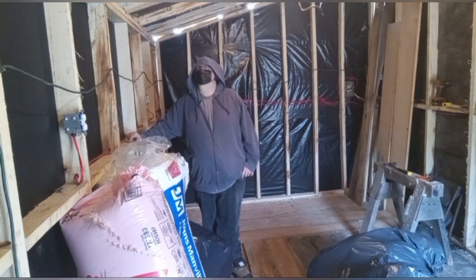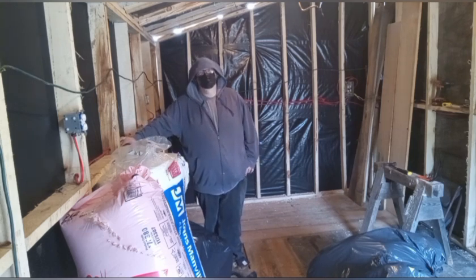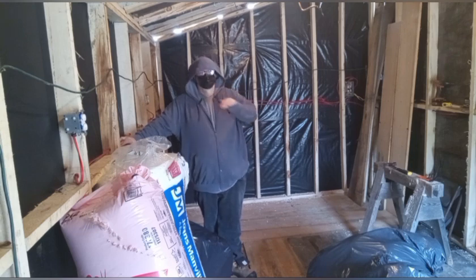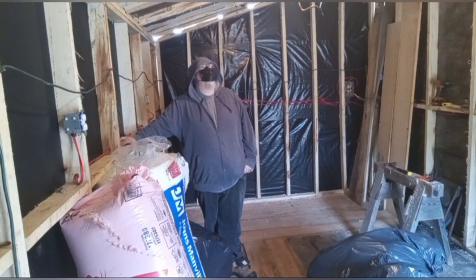In the last video, I was talking about putting cleats in for the foam board insulation in the ceiling. I had to scrap excess 3.5 inch ISO insulation, polyiso. For anybody not aware, that stuff is typically used for flat roofs. You lay down your bottom layer insulation, top layer, and then all your sheets of roll roofing. I was given a bunch of it a couple years ago, so I wanted to put that in the ceiling to account for a bit more thickness.